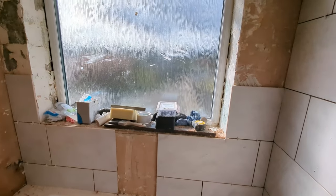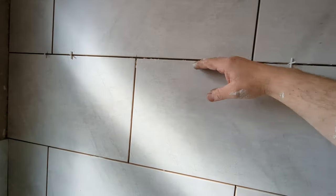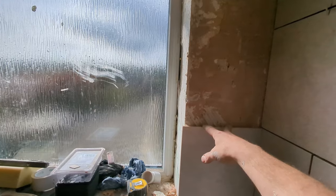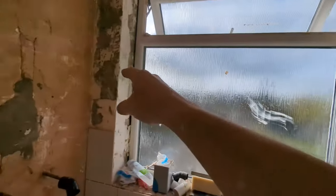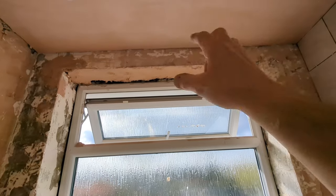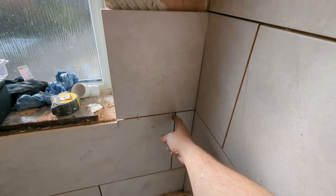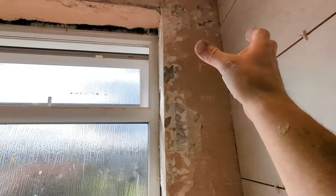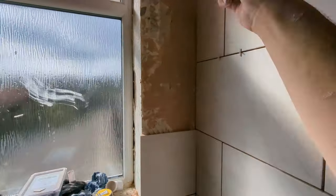When you go on either side of a window, even with these tiles, it's not a completely straight line - hold a straight edge against the edge of the tiles and they kind of go in slightly at the ends. That's common with all ceramic tiles: when they're put in a kiln they shrink and warp a little. If you just rely on your two spacers from one tile to the next the whole lot could start leaning to one side, and when you try to join up in the middle you might not even have enough space for a whole tile. Good practice is to mark where your grout line should start, put a straight edge along with your level, and follow that mark all the way up both sides.